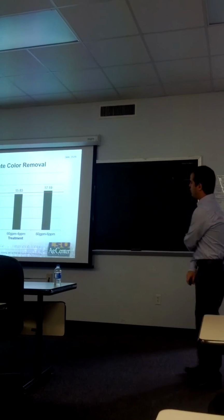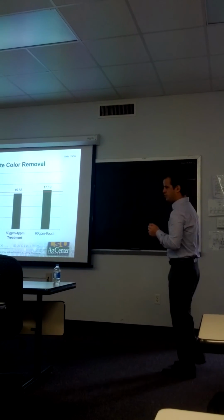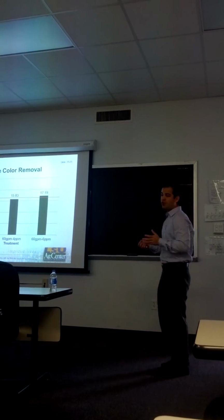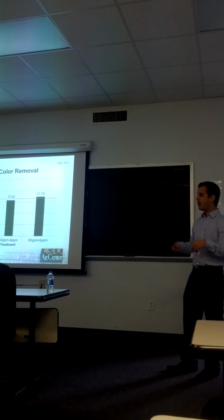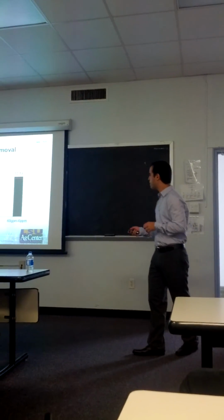And the color removal achieved in the clarifier ranged between 15 and 20%, and it's comparable to other studies of filtrate clarification where they used clarifiers with high residence times, and our clarifier achieved the same ranges.